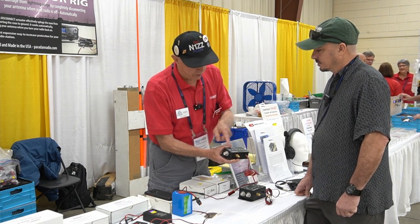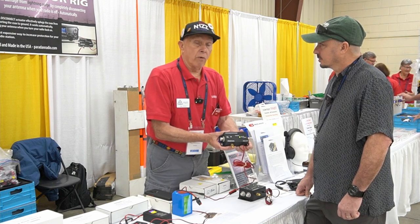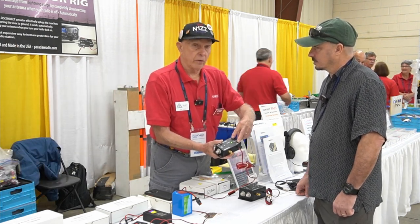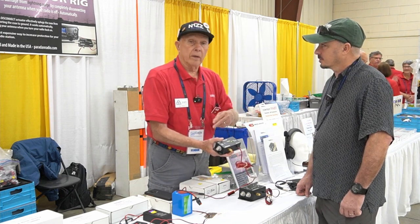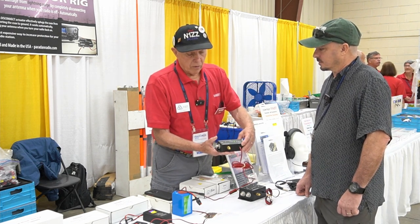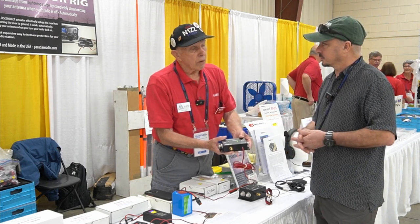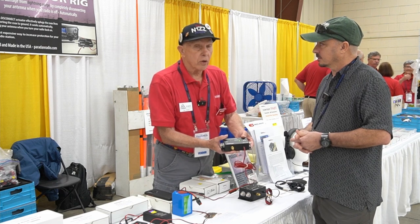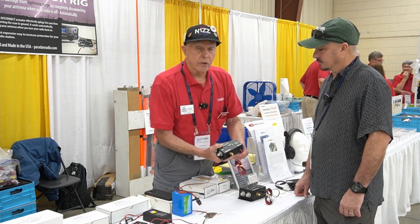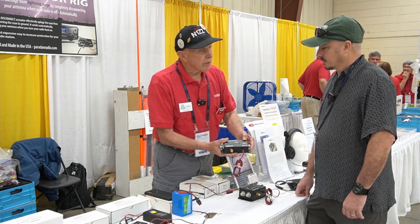The ground over here is connected to the ground of the system. So now you are totally connected up, but a lot of things are going on. Number one, there's a gas discharge tube in here — like a polyphaser-type gas discharge tube. So when you're on the air, if there's a spark that happens because of a lightning surge, it will short that out, so you have that protection too. That gas discharge tube — do I have to replace it if it's used to protect my device? Well, you should eventually, but the gas discharge tube here is never in the circuit until you're on. When it's in the safe mode, the gas discharge tube is shorted out. So most likely that gas discharge tube hardly ever gets used — only when there's a strike in the area.